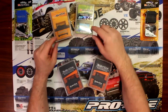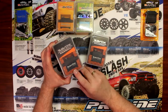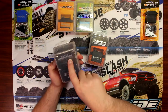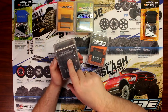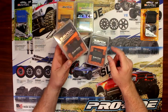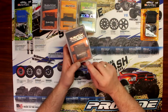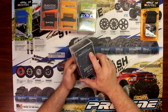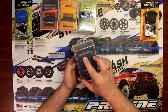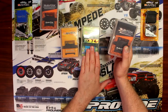Now for those who don't like the orange or blue case, there's the black edition of Savox. The SC1258TG has titanium gears, 166.6 ounces of torque, speed of 0.08 — a very fast servo — at 52.4 grams, all in black with aluminum casing. There's also the SC1256TG in black — 277 ounces of torque at 0.15, 52.4 grams. Same torque as the SA1256TG, but in a blacked-out finish.